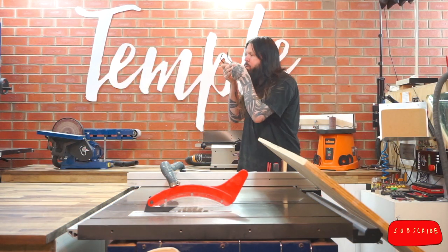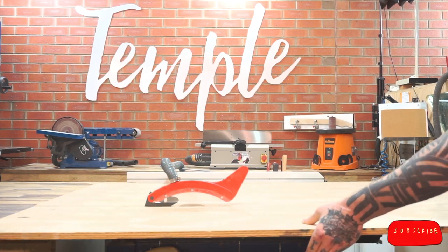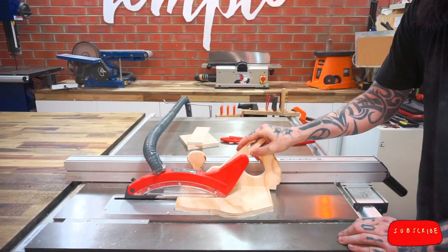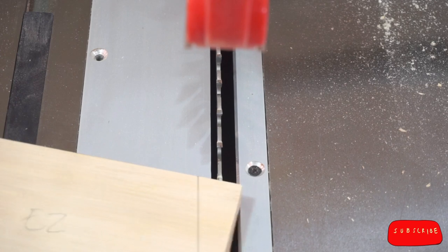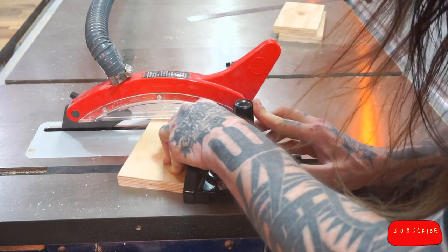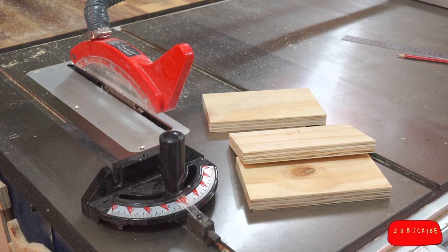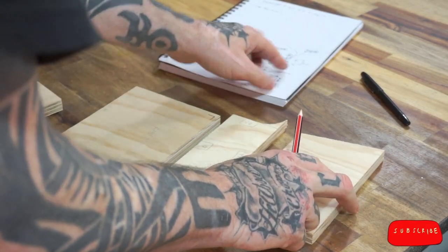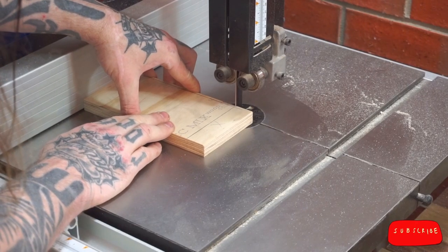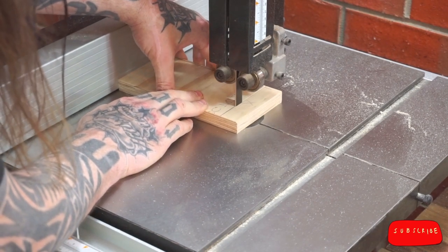I've drawn out my parts onto a big sheet and I need to rip it down into more manageable pieces. First I cut out the general area on the table saw, then free the individual pieces on the bandsaw, then back to the table saw to cut them all out properly. I used my fence and push sticks first, but I haven't made a cross-cutting sled yet, so I line up my lines with the blade and run them through using my miter gauge. If you're careful and take your time, you can get very accurate results. At this stage I check my pieces against the plans, just to make sure everything is right before I go any further. I've set up my bandsaw to be super precise, so I can use it in lieu of a cross-cut sled until I make one — I'll do a table saw episode with about six jigs in it.